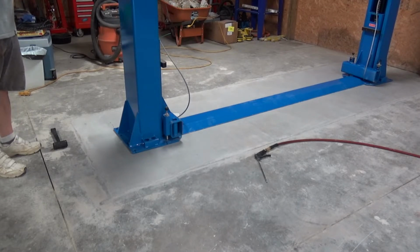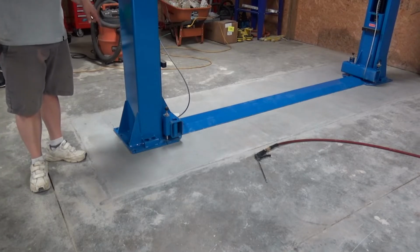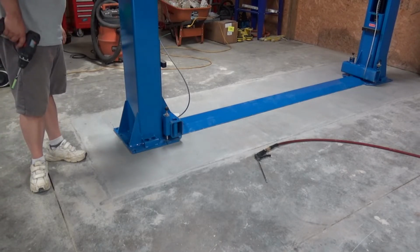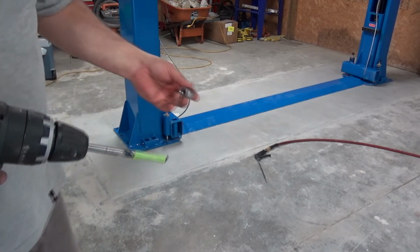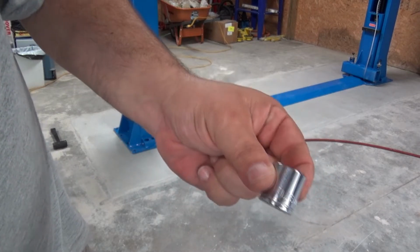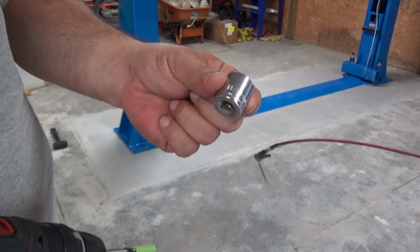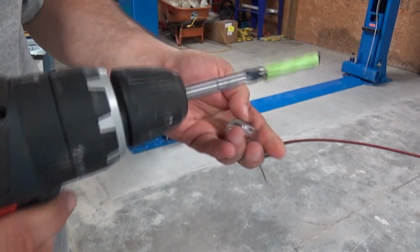However, getting the 3/4 inch concrete bit dead center in these holes is not that easy, because the hole's a little bigger than 3/4. So what I've come up with is, I'm sure this gets in there. It's an old socket. It fits the diameter of the hole perfectly,